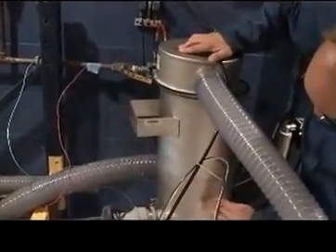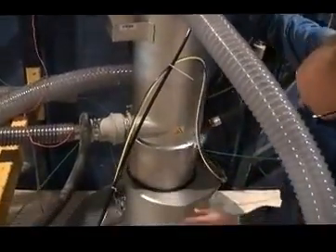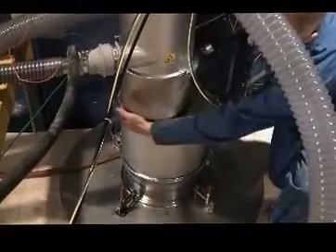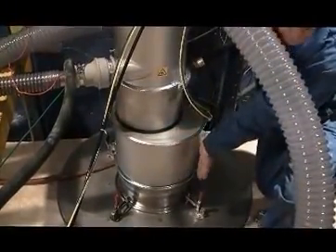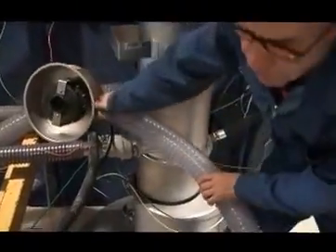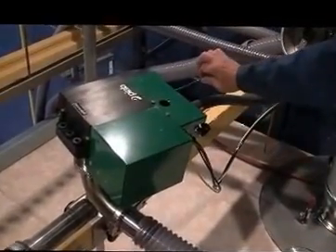The filter inlet is 3 inch reduced to 2 inch, and it is grounded. The volume module and the bottom valve are fully open — it opens up 10 inches via an air-operated actuator. The vacuum pump is driven by compressed air and gets the signal to start.